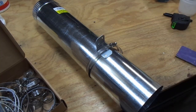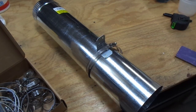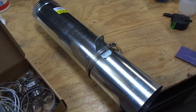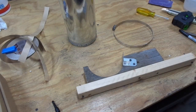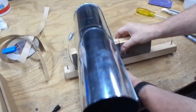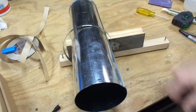Here's a simple mock-up of a way to secure the ductwork. You just need a basic angle bracket and a hose clamp. When you tighten this down — assuming the bracket is firmly attached to something like a joist — this will hold the ductwork very nicely. Tightening the clamp forces the duct more or less into a circle, so you're accomplishing two things: maintaining the shape of the ductwork and securing it. Here's a bracket I made to support the ductwork right in the area where I'll be attaching hoses. The two screws on either end go up into the joist, the band clamp sits in the cradle, and as you tighten it the cradle stops the duct from moving left, right, up, or down.